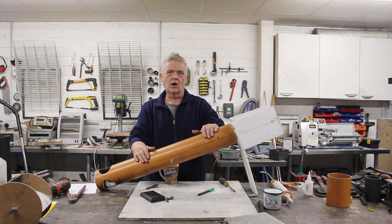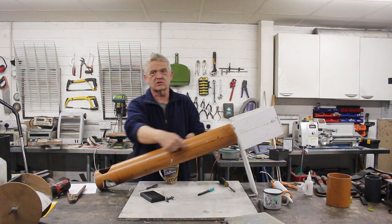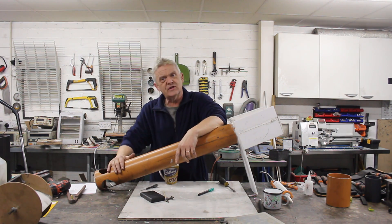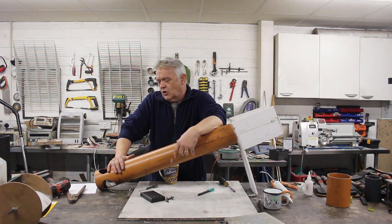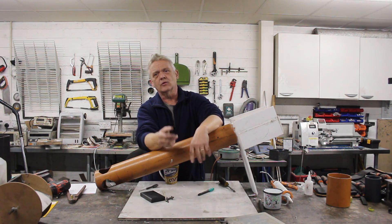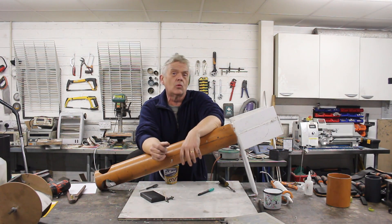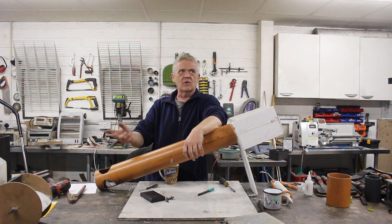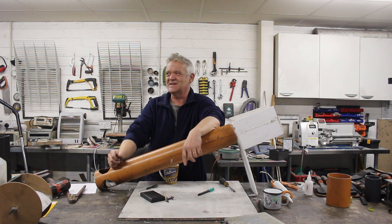There's another type you see quite often where it's only a half pipe — the top section is removed. There are reasons for that: if you get leaves down there you're likely to jam it, and if it's a whole pipe that clogs, that's it. With a half section it's much easier to clean out. So with lots of these things it's all about what is appropriate to the situation. If you're doing rainwater, just put one of those cages at the top so the leaves can't go down — it seems pretty easy.